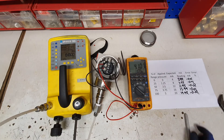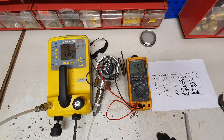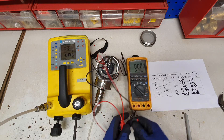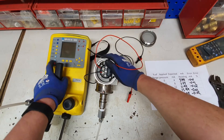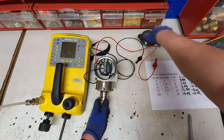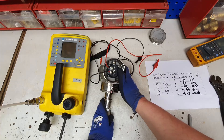We will just turn our equipment off and then we can work out the exact error as a percentage. That is our calibration check completed, including the rerange. We will just remove our probes to kill the 24 volts, turn our meter off, remove the electrical connections, and then that transmitter is ready to be used in the field — and it is calibrated.